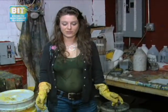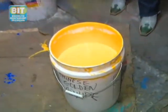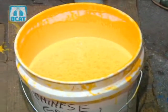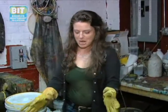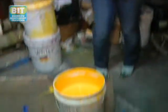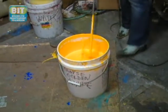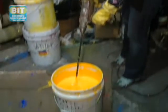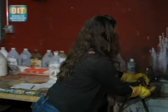The way we get started is we get our formula together and put it in a five-gallon bucket, because we make five-gallon batches of color. What goes in the bucket is the dry pigment powder, the surfactant, and a few other things I won't mention — but it's all water-based and non-toxic. You don't want to drink it, but it's beautiful stuff. Then we get our drill and spin it around, making sure all the dry pigment is wetted — and that's what the surfactant does: it wets the particle.